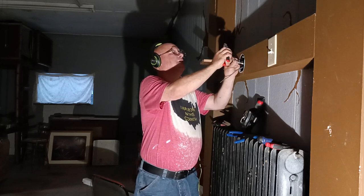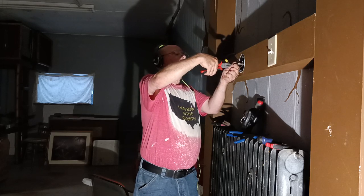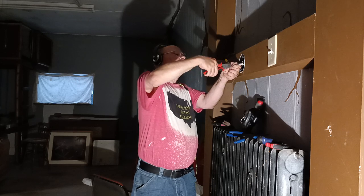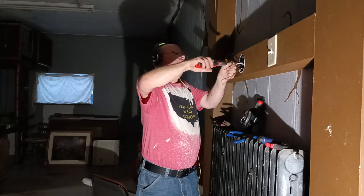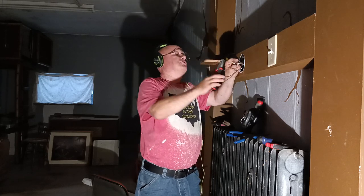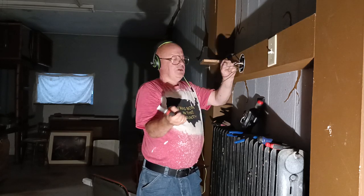The reason the black feed wire goes to the white switch wire is so that the black wire coming back to the light is live, and the white is neutral, that the white from the light will go to. So we got them twisted evenly here. We'll cut it so it's even on the end there.